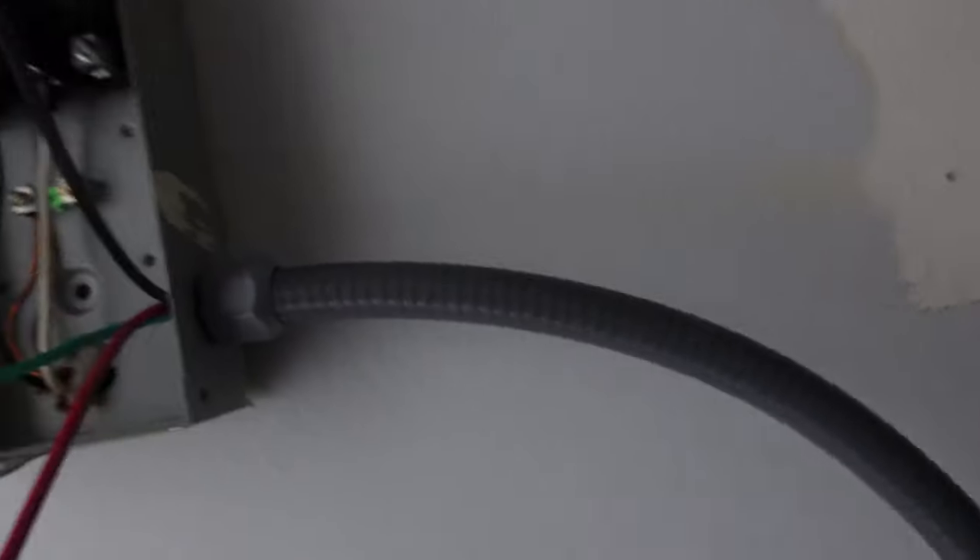Make sure that you put your covers back on your disconnects. This is wired up, so all we'll have to do when we're ready to fire this water heater up is plug in our disconnect. But right now the water heater is still dry and I definitely don't want to turn it on while it's dry - it'll burn out both elements. Now let's wire up the water heater.